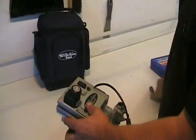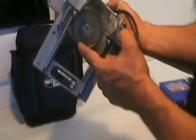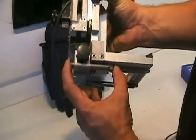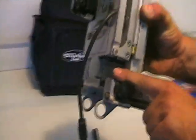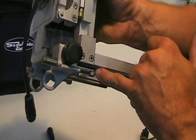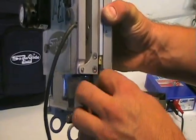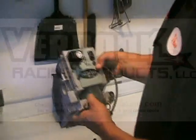You have your on/off switch and your power cord which connects into your power source. You have your diamond cutting wheel, which in this case will cut on the edge of the fine wheel. Another part of the base edge portion is the depth of cut, done with this rod which is connected to this barrel. It has a locking nut on the back side that needs to be loose. Once you loosen that barrel, it moves in and out and is connected to this bearing — this will be your depth of cut. Always make sure that you remember to lock the locking nut.